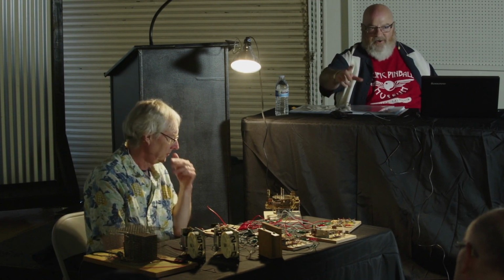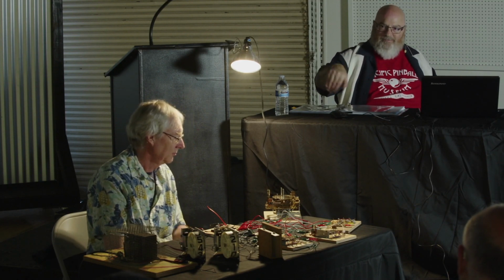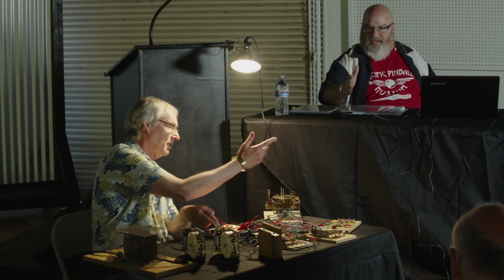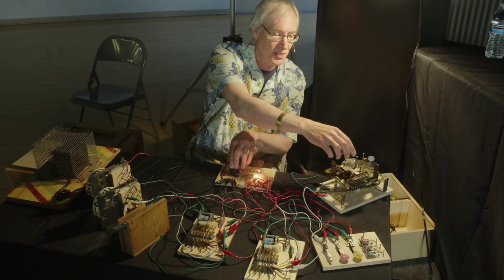And there is a switch in all those switches on your motor that doesn't need anything else to happen. It's the one that makes your motor go back to home from wherever it starts. It's going to end up and stop in the same place all the time. So this is a great test if you're never sure if you have power in your game, if the fuse is any good. All motors have a home position switch.